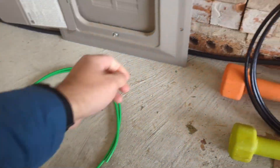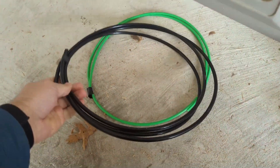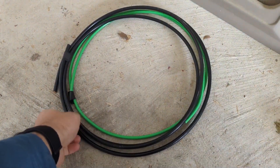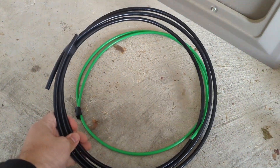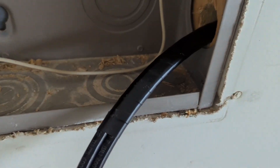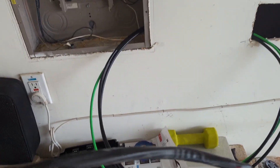I've already prepared the wires — this is the ground, this is the hot. This black wire I'm gonna split in half and mark the other half with red electrical tape. This is how it's gonna look like when everything is complete. I also wrapped all the wires with electrical tape to protect the wire inside the wall.